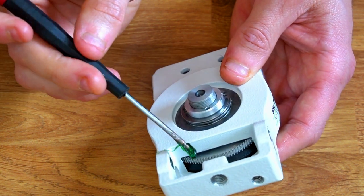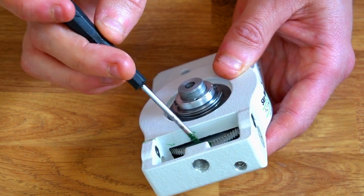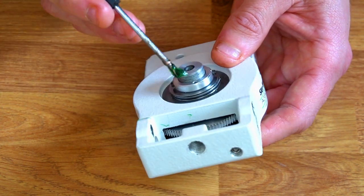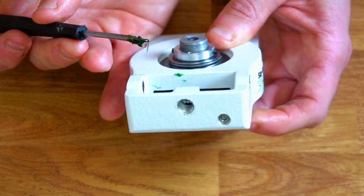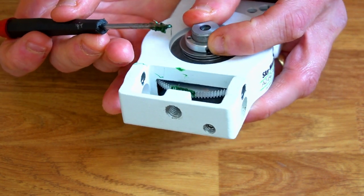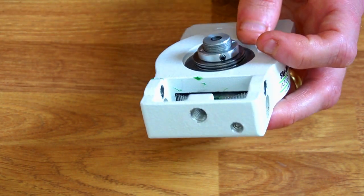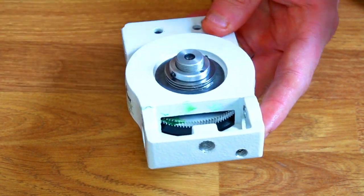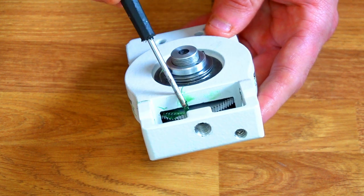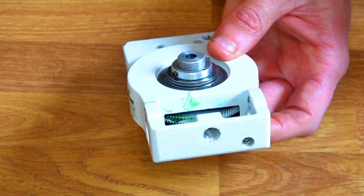and you're just going to carefully butter lightly between there, right? As you can see there, I've only put a little bit because you don't want to put too much. As I rotate it round along here, I'm just going to butter that in there all the way around. And as I'm buttering it, I can turn the spindle around, all the way around. I just want to get it on the edge. I don't want to get it passed onto the friction plate.